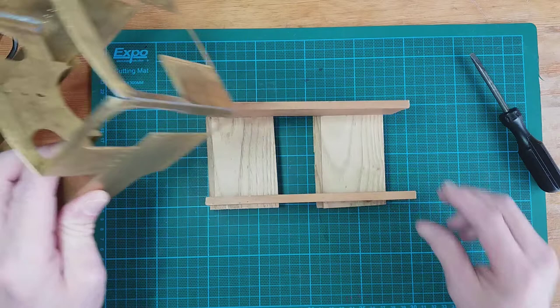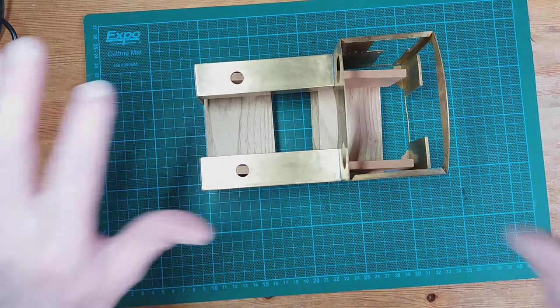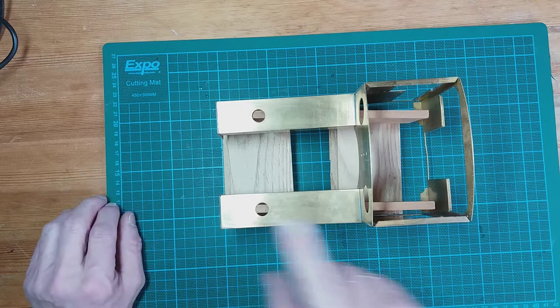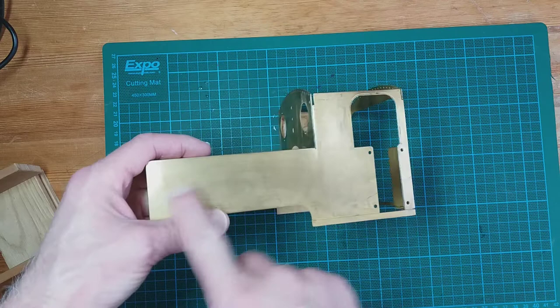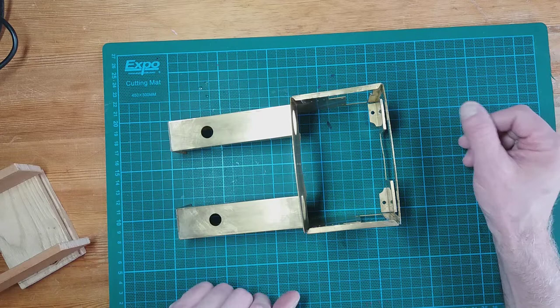For the outside, I've made from some scrap wood a small mounting, and the loco will go on that mounting so I can get round everything without having to touch it again and paint the outside, which is obviously the most important part. What has to happen first is another degrease with the stuff I showed in the last video, then lightly go over everything with 400 grade sandpaper, being careful with the rivet detail, and then wipe it clean with white spirit.